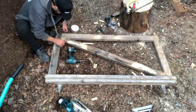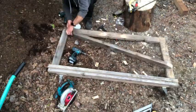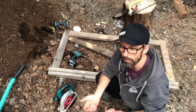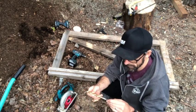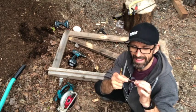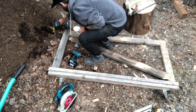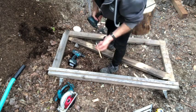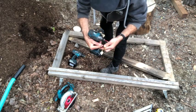I might try and come in at an angle like this — that's almost too long. Okay this is a nightmare. I think you're supposed to use like a pocket drill bit, but I don't have one. So what I'm going to do is drill halfway into the wood with a drill bit that's the same diameter as the head of this screw, so I can get the screw in without too much resistance. That'll also allow the head of the impact driver through a little bit, and by drilling only so far in, that'll allow the screw to go in nice and easy and then bed up against something.